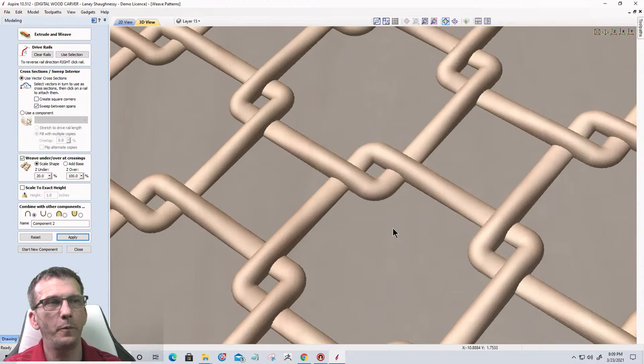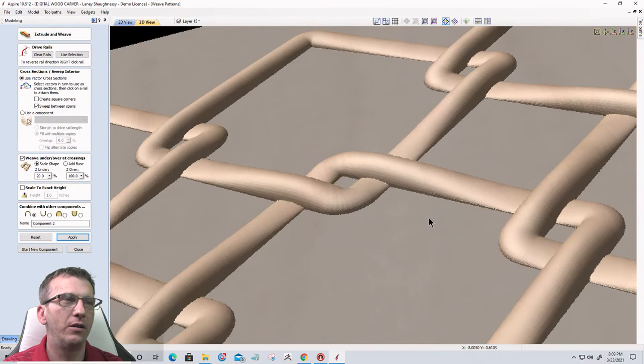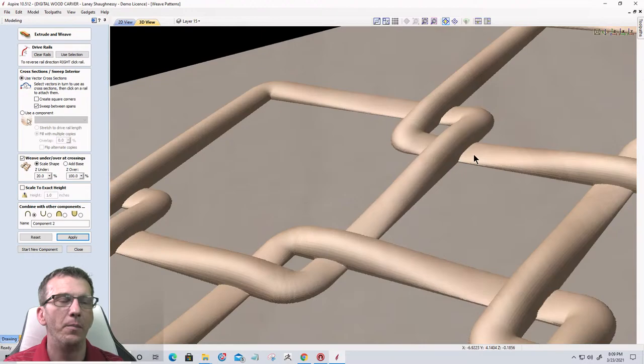So basically what has happened here, let's turn where we can see up here in the distance in this corner. Basically, it's flattened out. We have 100% of our shape coming over it, and in order to compensate, it's flattened out the under. We don't want that. We don't want to squish the under just so the over can go there. I'm a big fan of a 40% under and a 60% over, kind of splitting that difference of that 100% total.